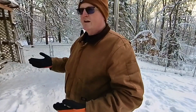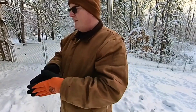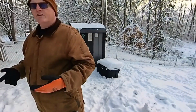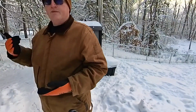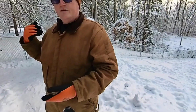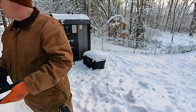One day of warm and then cold probably isn't going to do this, but when you have a long period of really warm and then you go into really cold, and even sometimes when we haven't had that, I've noticed it too, if we had a particularly cold winter, I think it's just something that builds up because of the difference in temperature. The air that the fan is blowing in is super cold, and the boiler is super warm. And anywhere you get condensation, you're going to get creosote.